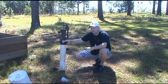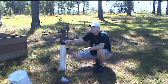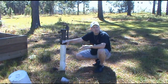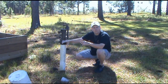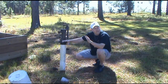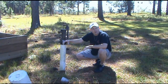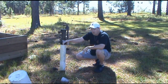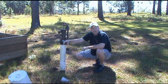I had a couple of questions going into this project. The main one was, where is my water table? I didn't want to dig a 30-foot hole and never hit water. What I found out through research is every time somebody drills a well for a home site or business, they have to report back to the local government where they hit water — so all this is public information. Just Google your county and state and 'where's my water table' and you should find maps showing your area's water table levels. Ours was anywhere from 12 to 40 feet. We hit it just past the 20-foot mark, and when this thing erupted it exploded inside the hole — water shot up, it was really loud, and water instantly filled the casing about nine feet. We continued to dig down another four feet into the water table to make sure we had adequate water.